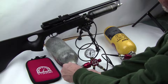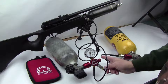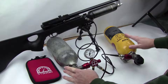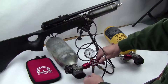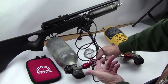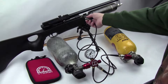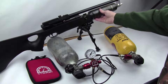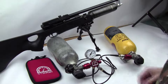I'll crack the valve and bring it up a little above target, then stop it. To bleed the system I'm going to use the integrated bleed line right here on the Stickman — since both valves are closed it's going to drain all the air from the system. The air blows out the back so it's not hitting me. Now I've removed it from the tank and we've successfully charged the gun, utilizing air from two different tanks to do that.